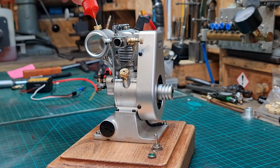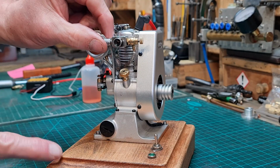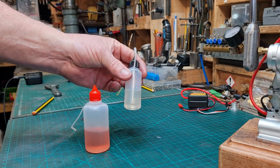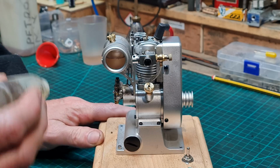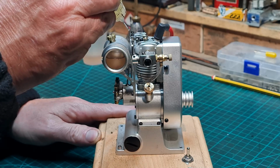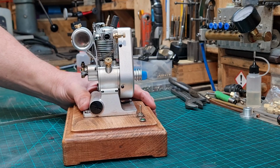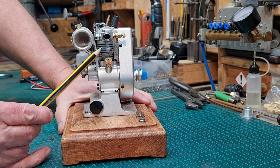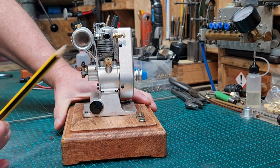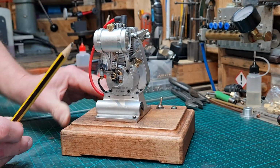The manual says that the engine will run with gasoline or kerosene, or petrol/paraffin in the UK, although I have only used it with petrol up to now. I use SAE30 mineral oil in the engine sump and to lubricate the external moving parts. There isn't any reference to show how much oil needs to go in the sump, but the engine will let you know if it's overfilled, as the excess oil gets sprayed out of the hole in the filler cap. I've been there and I've still got the t-shirt, even after several washes.